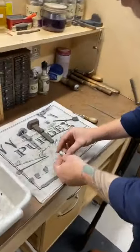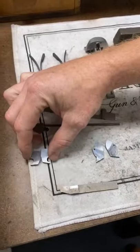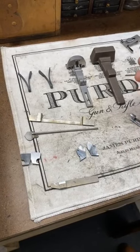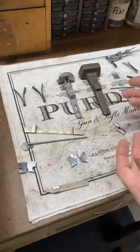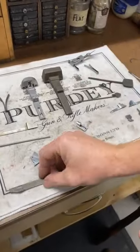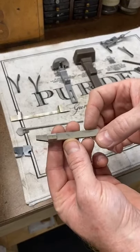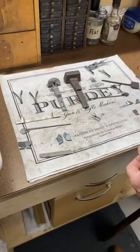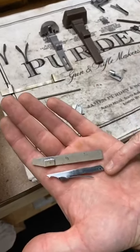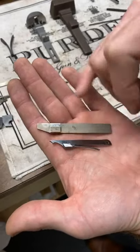So if you come around to this. We have cams, which a lot of people call kickers. We have front lifters, which is to do with the cocking work, which we also build. A lot of other makers actually buy ejector work in as a block. We make everything, all the components. So we've got side springs, main springs, and the most essential bit of our side-by-side build is a center arm. This gives a lot of feel through the gun and allows the components not to wear as quickly as they have done previously. So if you can see this here, we have that and that, the finished article and how we build it. Now there's a lot of regulating going on within that, from front to back, and I'll get into that later on.